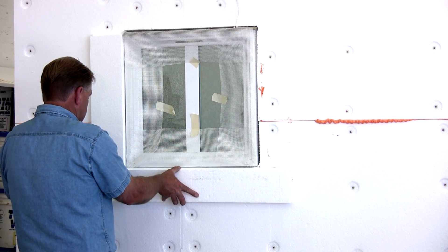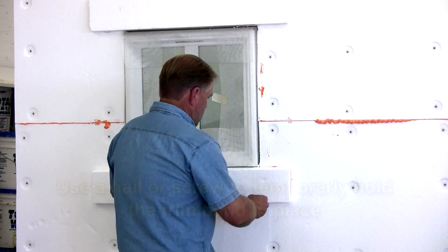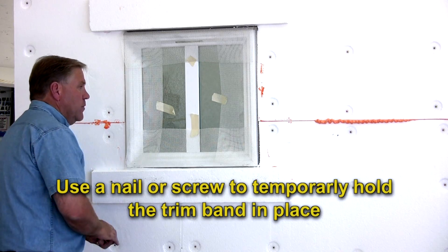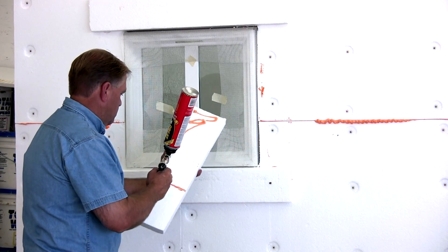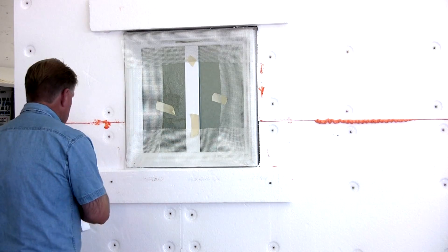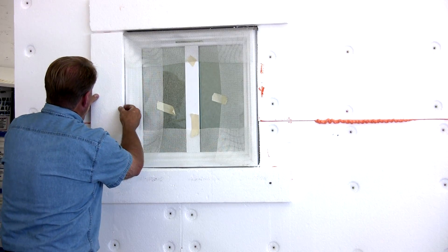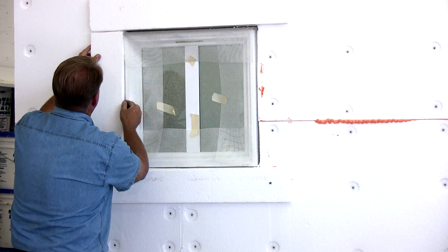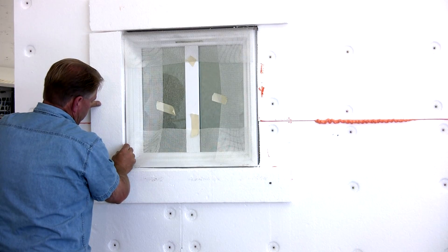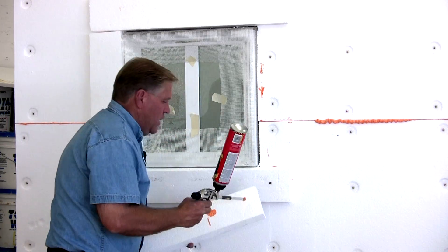Measuring that off, we'll slide that out to where it's going to meet the outside band. You can take a screw or a nail and just pin that in until the spray foam sets. We're going to hold that away from that window frame about three-eighths to a half of an inch, just like we have the base foam on there, making sure that we have room for a backer rod and sealant in there.